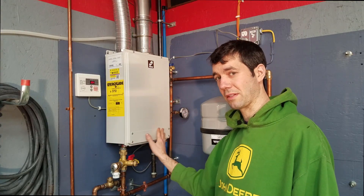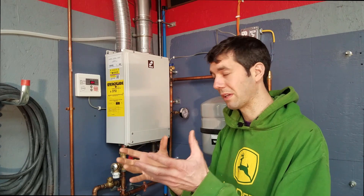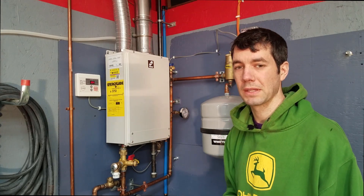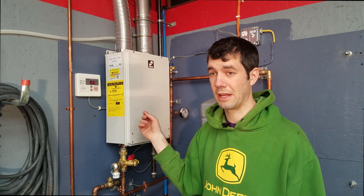If you don't have that cold air intake, this plate doesn't come on it — you've got to buy that separately. Without it, it will take air from your living environment and use that for combustion, but I didn't want to take warm air and just blow it outside. This runs on 120 volts, which is super convenient, and it doesn't even draw a lot of power — it just runs a little fan and the computer board.